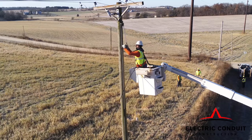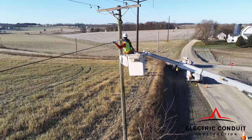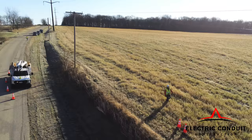At this point, poles have been framed and the fiber has been pulled out. It's time to put it into the tangents, tighten them down, and secure and tension the fiber in. Fiber is being tensioned in and the grommets tighten to hold the fiber. The fiber route will continue beyond the tensioning areas. We are figure eighting to continue our route down the line.